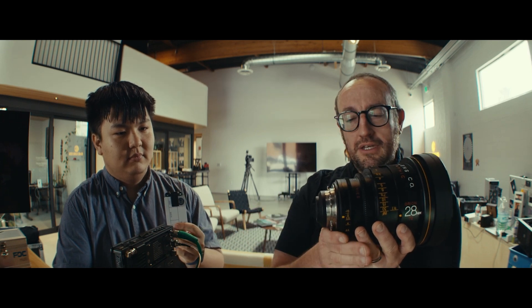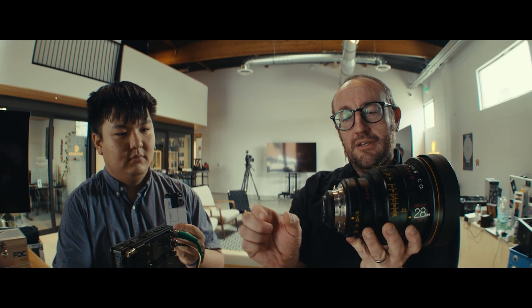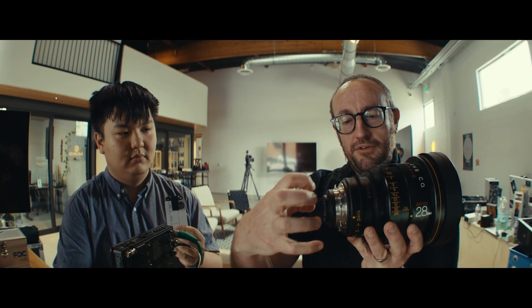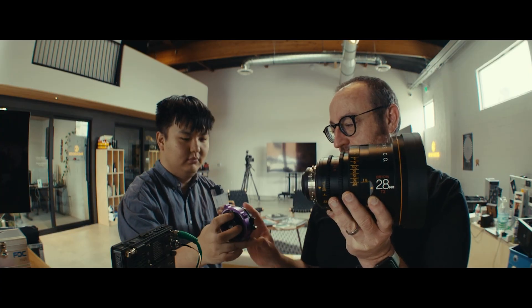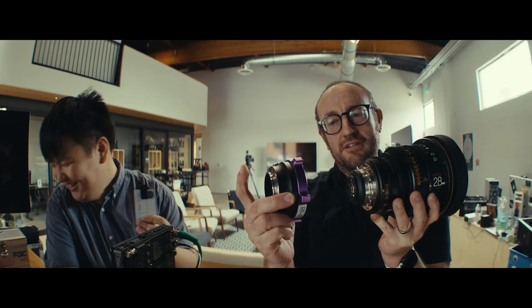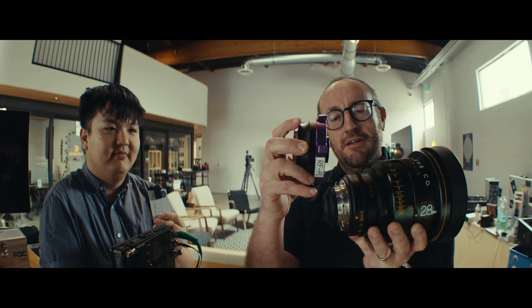So if you have a lens that expects a longer back working distance, you can easily adapt it to a camera that has a shorter back working distance, because normally that resting position would be about here and the image plane would be here. You can make a mechanical mount adapter — much like this one here, shout out to the folks at Mofage — that goes to a mirrorless camera like a Sony E, and that amount of space is filled in by this mechanical block.